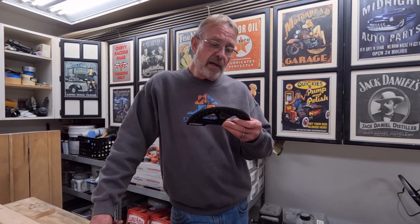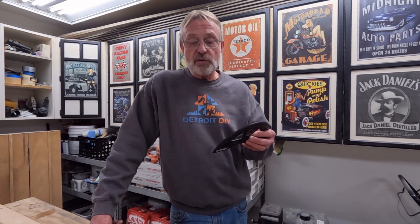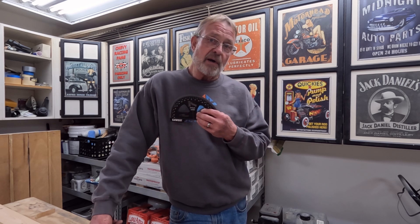The last thing I want to add is: if you take the angle from this miter protractor, go to your saw, cut it, and you do not get the desired cut you expected, something's off. Take a good look at your miter saw — I'll put a link in the description for a video on how to tune up your miter saw, because it may not be cutting what you think it's cutting. And that can also cause you problems. We don't want to pull our hair out — we want to use this Sawset, use our sliding T-bevel, check our walls for flatness, come to our saw, set it, cut it, install it. That simple.